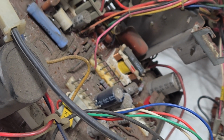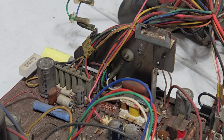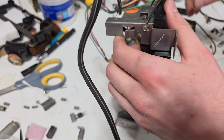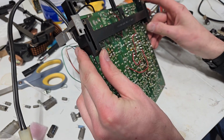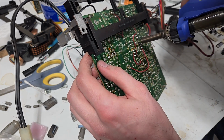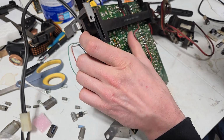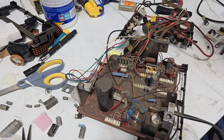Oh, shit. Yeah, I've used worse. Let's see what happens. So according to the schematic, that bad boy is supposed to be at 470 ohms. Let's yank that thing out and see what it tests. It's probably deader than shit. It's probably open. There's a good chance that just desoldering this thing is going to snap the thing in half. It's not snapped in half yet.